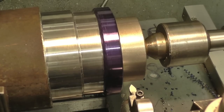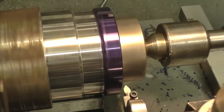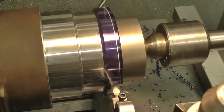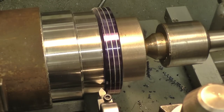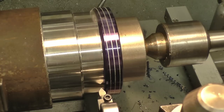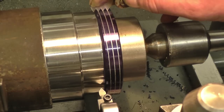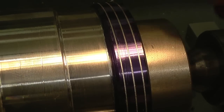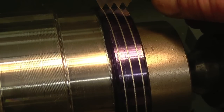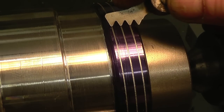We're all set to take a real fine cut. We'll start the lathe. The feed is engaged. It's a bit deeper than intended, but it's certainly taking a cut. We'll measure that. Absolutely perfect. I'll bring the camera in so you can see a little bit better. It's a 6 TPI gauge, which is, as you can see, a perfect fit.